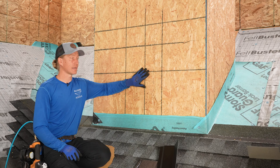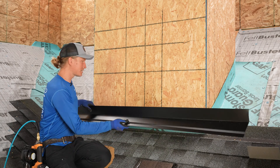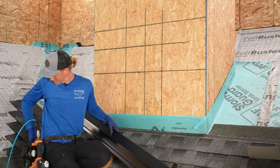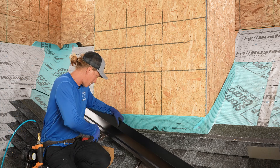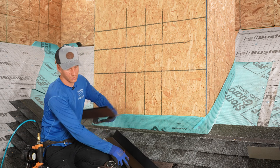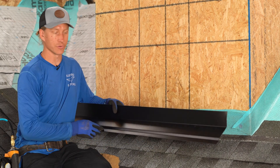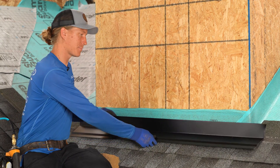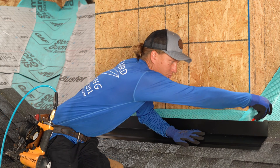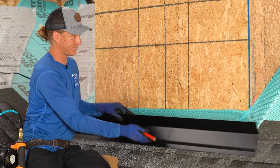Let's do our apron flashing and pretend like this chimney is stone or brick. In this situation you don't need to splice it like I did on the dormer — you're just going to make it so that it's four inches bigger on both sides and cut it off. I'm also going to show you an acceptable practice: instead of doing the clips on this one like we did on the dormer, we're going to use gasket screws to fasten the bottom. Both are acceptable practices for Bluebird. I personally like the clips so that I don't ever have to mess with a drill or screws, but it is up to the crew and the job to decide how it needs to be done.